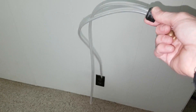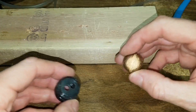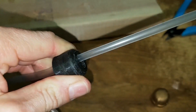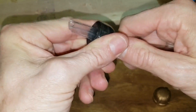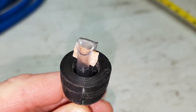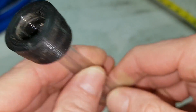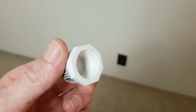The 3D printed cap with the two holes in the end worked okay in the previous video, but a standard cap from the hardware store with two holes drilled for the tubes would have been a better choice. This relatively small cap doesn't have much room to space the holes apart. The problem is that the two whips tended to twist around each other quite often when they were this close together exiting the cap. I'll show the issue later during testing. Cutting the tubes down to about 12 inches solved the problem but increased the minimum pressure requirement and also reduced coverage. This one-half inch schedule 40 threaded PVC cap will need an adapter but it should work fine.